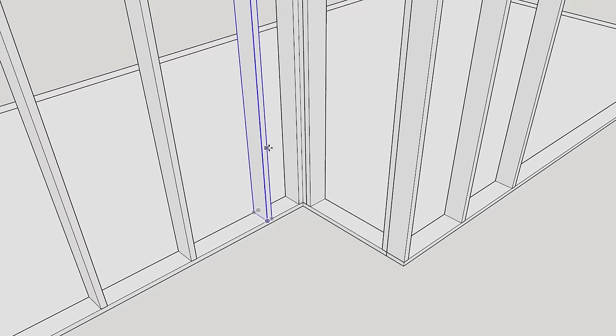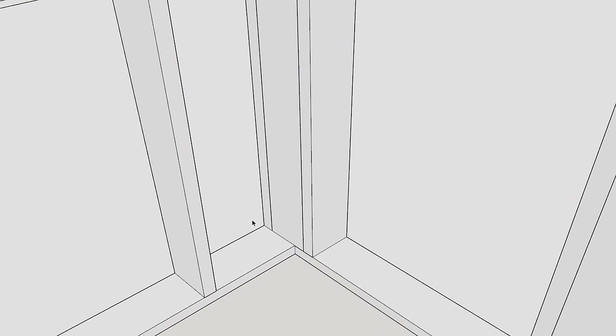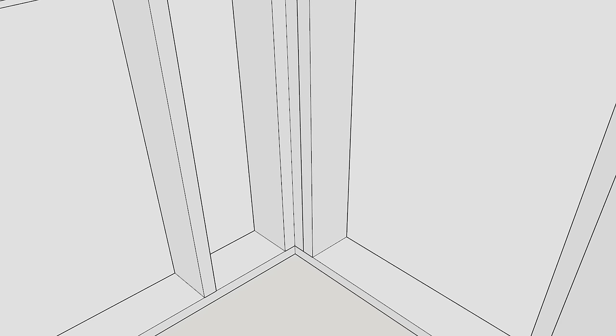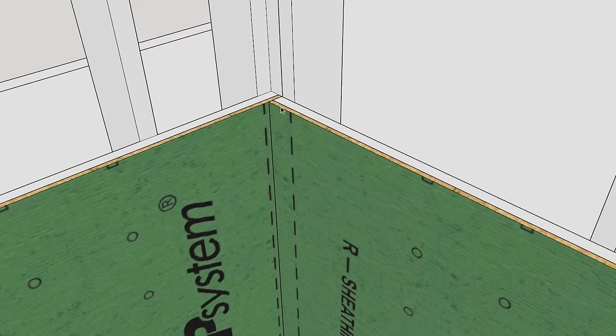Now when we come to an inside corner, here's the only real change that needs to be made. We just need to add backing. I go with a two-by-six on edge, a two-by-six flat, and a two-by-six on edge — that allows us to insulate behind it. Then I would have a stud here. Because this panel is now offsetting this, I need to make sure I have backing. If I wouldn't have done that, I would have no backing for this. On this side, this is all the backing I need because my siding — it's okay to nail that into the panel. I already have solid backing here.